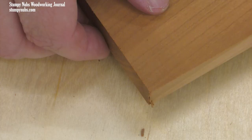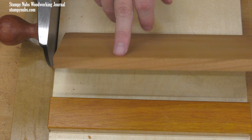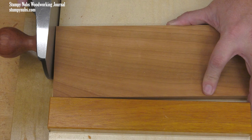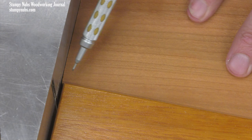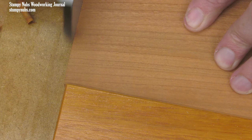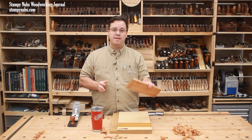One of the problems that comes with cutting end grain, whether at a table saw or with a plane, is the chance of chipping out that corner where the cutter exits the wood. Here is a clever technique to avoid that. I will flip my board so the finished edge that was against the fence is now my leading edge. Then I will slightly angle the board away from the fence and take a few cuts on just the corner. This creates a small chamfer. As I flip that edge back to the fence, you can see there is a little gap where that chamfered corner touches the sole of the plane. If I stop planing the end grain just as that gap disappears, I will eliminate the risk of chip out and get a crisp corner every time.